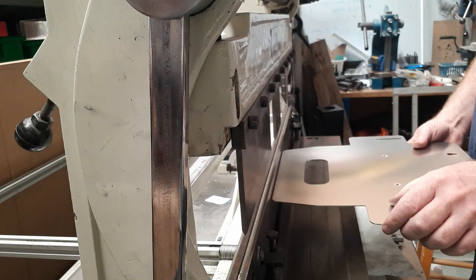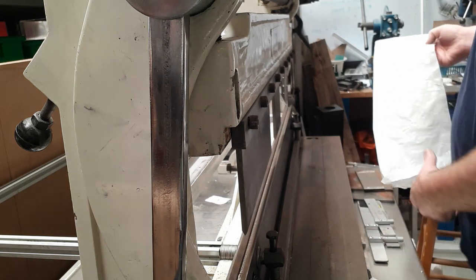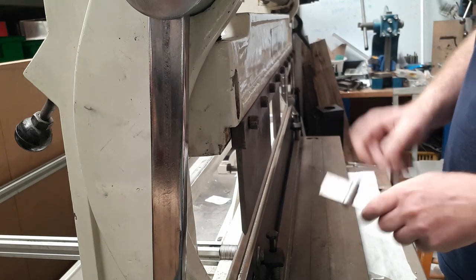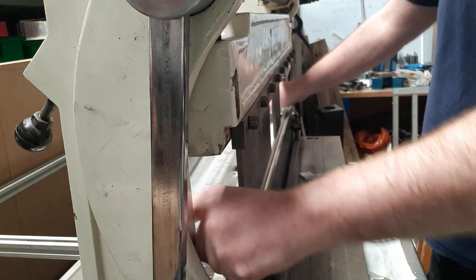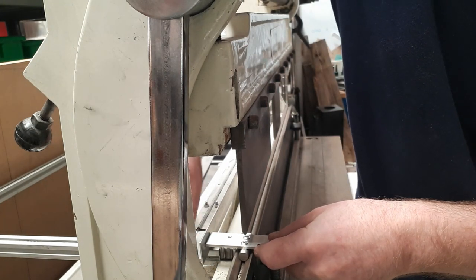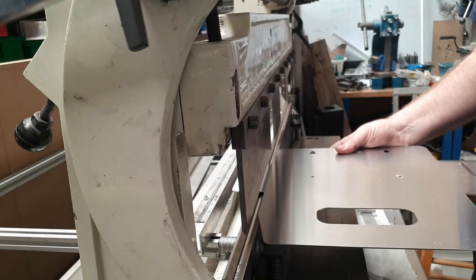The first I need to set to 45 to get that right. As I mentioned in the last video, I use a lot of jigs and guides to minimise setup time. This one tells me it's a 45-side, so I need to get this one ready — I'll loosen the fence off at the back, bring it forward, and measure that to 45. I'll do the same on the other side. Before I go ahead and bend, I'll just visually check — I'm happy with that.